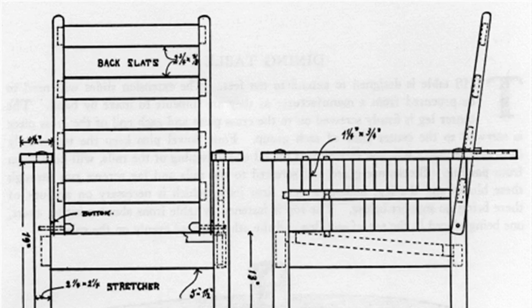From the planks: 2 pieces at 4 inches wide x 25 inches long for arms; 2 pieces at 4 inches wide x 15 inches long for side rails; 2 pieces at 4 inches x 22 inches long for front and back rails; 1 piece at 4 inches wide x 23 inches long for the back support rail; 4 pieces at 4 inches wide x 18 inches long for back slats; 6 pieces at 2 and 1/2 inches wide x 14 and 1/4 inches long for side slats.